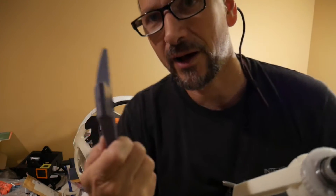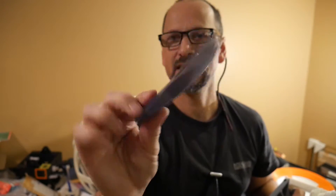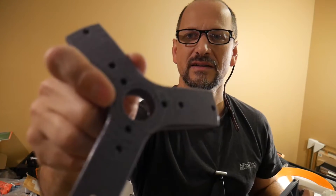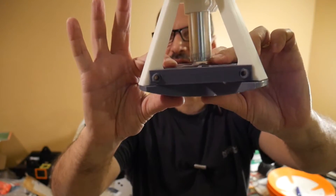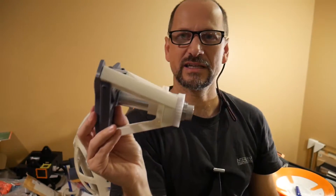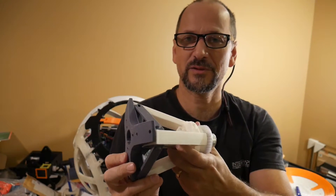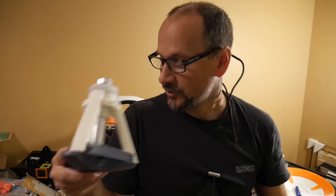I did make up the difference by changing my hub adapter. The old hub adapter was a bit overkill — it really just needs to be a spacer. The new version has more infill but fewer perimeters, so cosmetically it doesn't look as great but structurally it's actually better. It attaches so it matches the curve of the sphere and matches the hole patterns in Carrie's design. I had one installed already and within a few trial runs the old one snapped off — so now I've got one new one in and know it's working really nicely and rigidly.